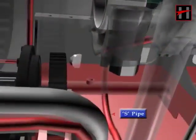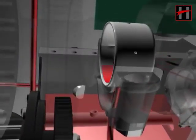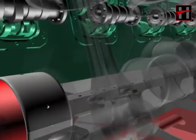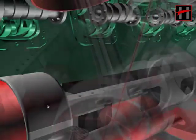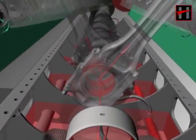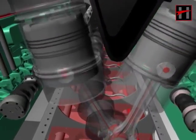The main header is fixed on the lube oil sump of the engine block, on which nine S-pipes are fixed. Through these S-pipes, the lubricating oil comes to the main bearings and lubricates them. The lubricating oil then passes through the holes of the crankshaft, lubricates the crankpins and the connecting rod big end bearings. From there, the lubricating oil passes through the rifle holes of the connecting rods and lubricates the gudgeon pins on the small end of the connecting rods.